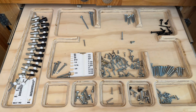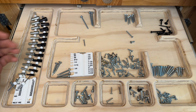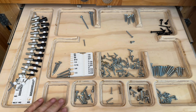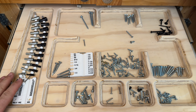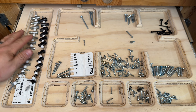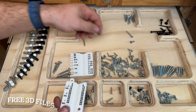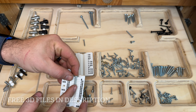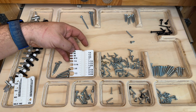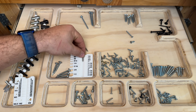And here is our sorting tray. As you can see, I can just chuck nails, screws, bolts, whatever I want on here, and then it's easy for me to sort them into an area before I retrieve them. I have some small little bins in the front. Over here on the side, I have my bolt tester, so I can check nuts and bolts — both Imperial and metric. I can use my bolt sizer right here, so if I were to take a bolt of some sort, put it on here, it tells me that it's an M18. This guy right here is for screws, so it'll tell me if it's number 4, 6, 8, 10, and how long it is. You just put the screw there — it makes it pretty easy.